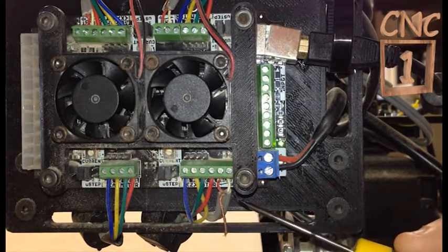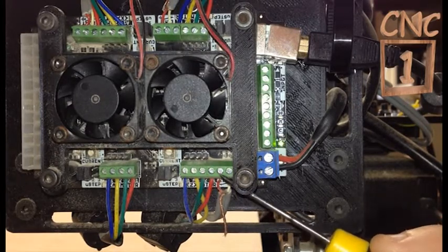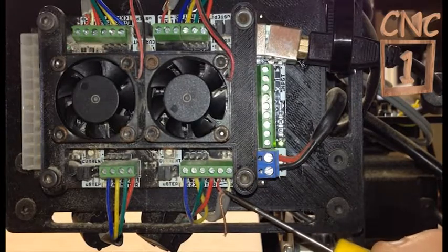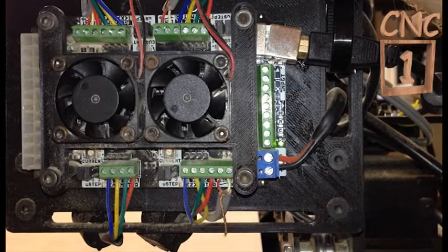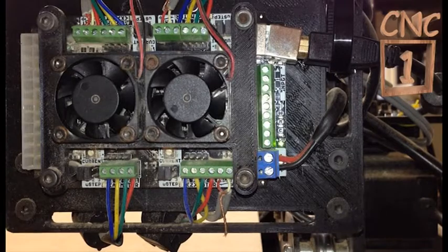This is my X-Pro. This is where the micro switch wire comes to. There are two screw connectors and that's where the two wires from your micro switch go. This bottom one is for the Z-axis, this one up here is for the Y-axis, and this one here is for the X-axis. It actually says it on the circuit board — you can't really see it underneath the wires — but it says 'limit' and there's a little diagram of a switch. You just wire your wires into there.